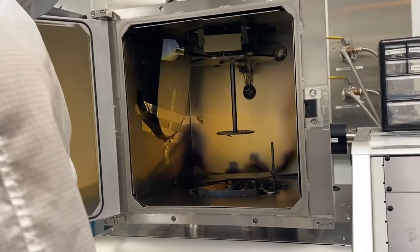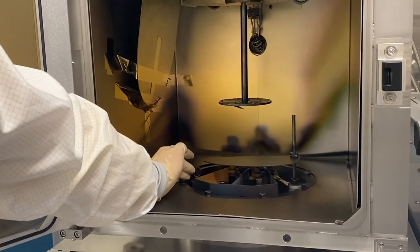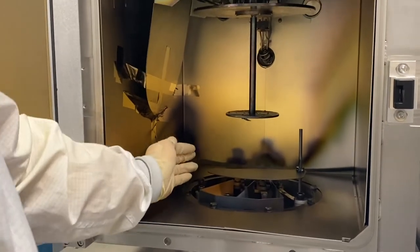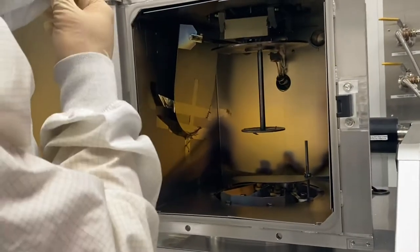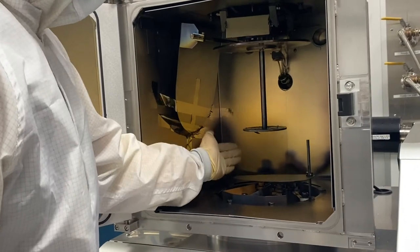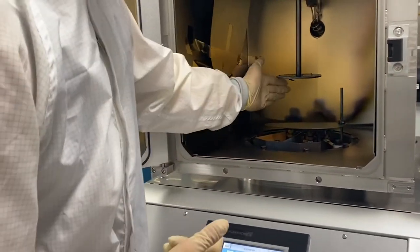Because copper is out here and we're using the extender, the deposition rate might be a little uneven. Everything evaporated has what's called a Gaussian profile — maximum density centered right above the source, falling off equally on both sides. That means the sample won't be in the center, so it's really important that you spin the sample to get an even coating. Otherwise, one part of the sample is going to be a lot thicker than the other.